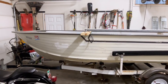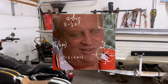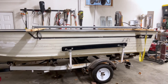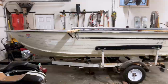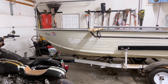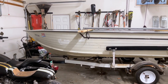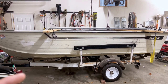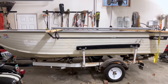We're going to move the boat forward on the trailer while installing the new lit trailer bunks. With the motor on the back, the tongue of the trailer should carry seven to ten percent of the total trailer weight. When we move the boat forward, it's going to shift more weight onto the tongue, so we'll need to move our axle forward to compensate and restore the correct tongue weight ratio.